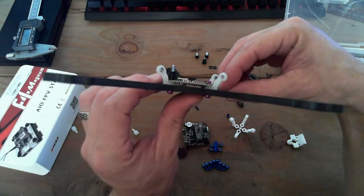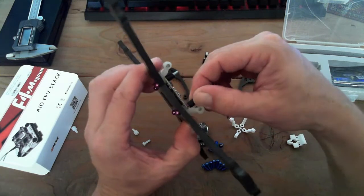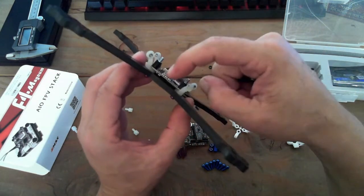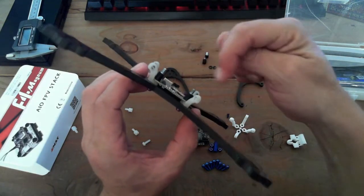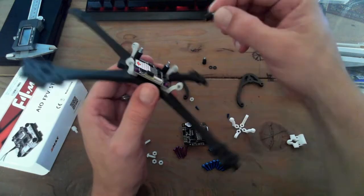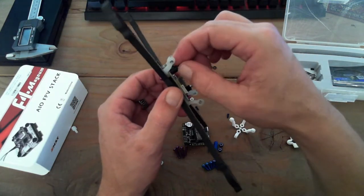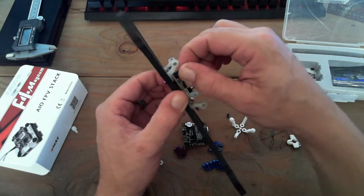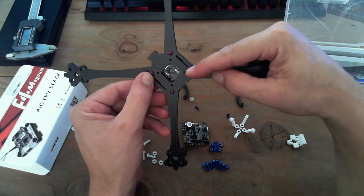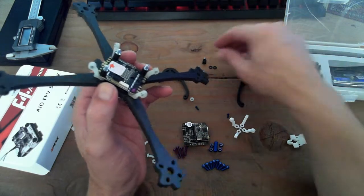I mean, it's not really crimping that at all. It's just kind of there. Okay, here we go. Let's put the other guys on here, and I'll cinch this all up so that it sort of stacks. There's no FC or any chips on here, but it's stacked between basically two pieces of rubber. These dampeners will isolate the FC on top so that it receives less vibration from our frame via the bottom screws and from the canopy due to wind buffeting.